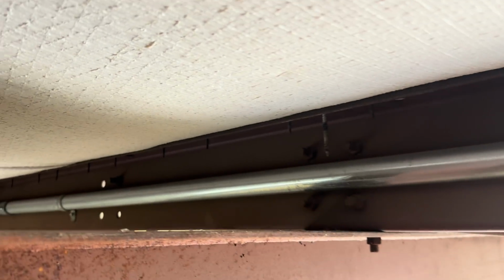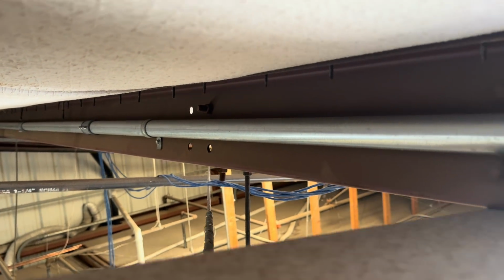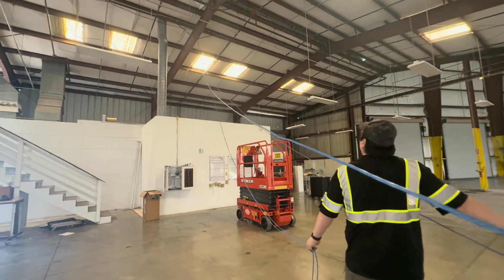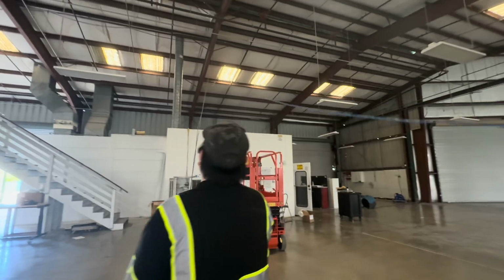We've carefully traced our path through the ceiling so that we know we can tighten it up later. So there's a little bit of logic to the path that we took. But at this phase, it doesn't need to look super clean. We just want to get the wires physically exactly where they need to be. The tightening up phase, or what we would call dressing the cables, that will come later.